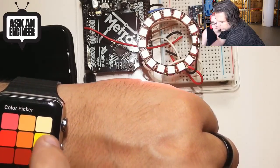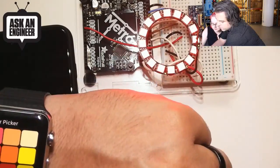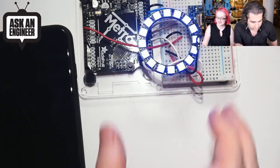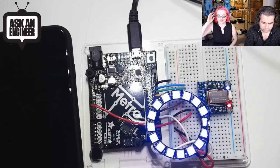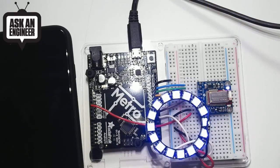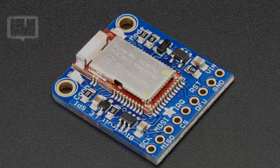With palette mode you can swipe to get more colors — like blue — and disconnect at any time. That's a live demo, and it's dangerous! We did a demo with iOS, and you can use your Apple Watch if you want as well — we're working on that support. You can use any Android or iOS device to control the Bluetooth. We have it in two flavors: UART and SPI. I kind of like SPI because it's a little bit faster, you can use any pins, and you don't have to worry about flow control or interrupt requirements for software serial. It's very easy to port the library over to your favorite microcontroller.